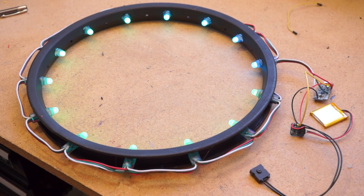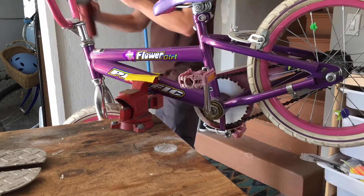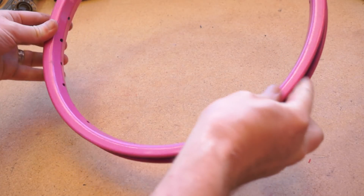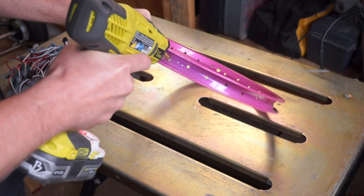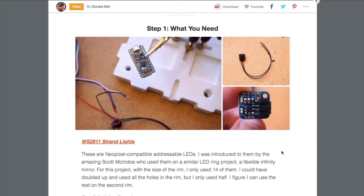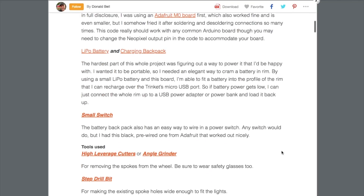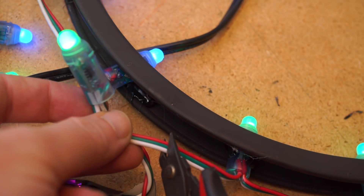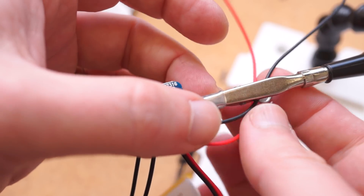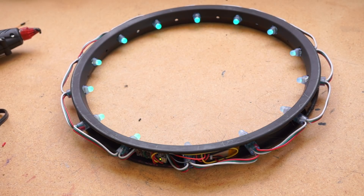Time for one more project — this one is something I made for a change. Remember last week when I was inspired to reuse the parts from a bike I tore apart? I challenged myself to turn a bike rim into a cool color-changing LED ring, and it works. I have everything written up as an Instructable, including the list of materials and the code. Basically, it's a strand of cheap WS2811 LEDs connected to an Adafruit Pro Trinket board, a battery backpack, a tiny LiPo battery, and a button to switch it on and off. I love how it turned out, and I still have a second rim left, so I'll probably make another one to match it.